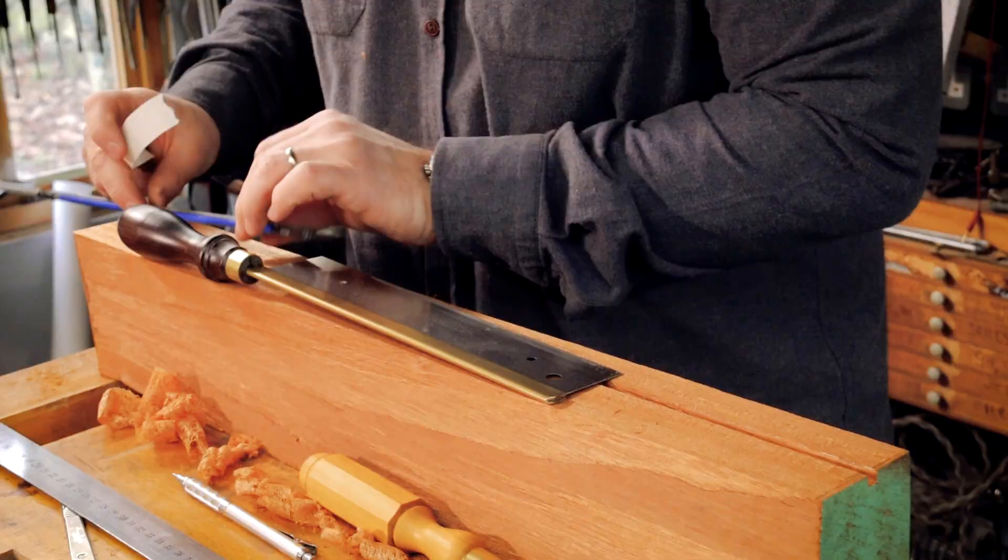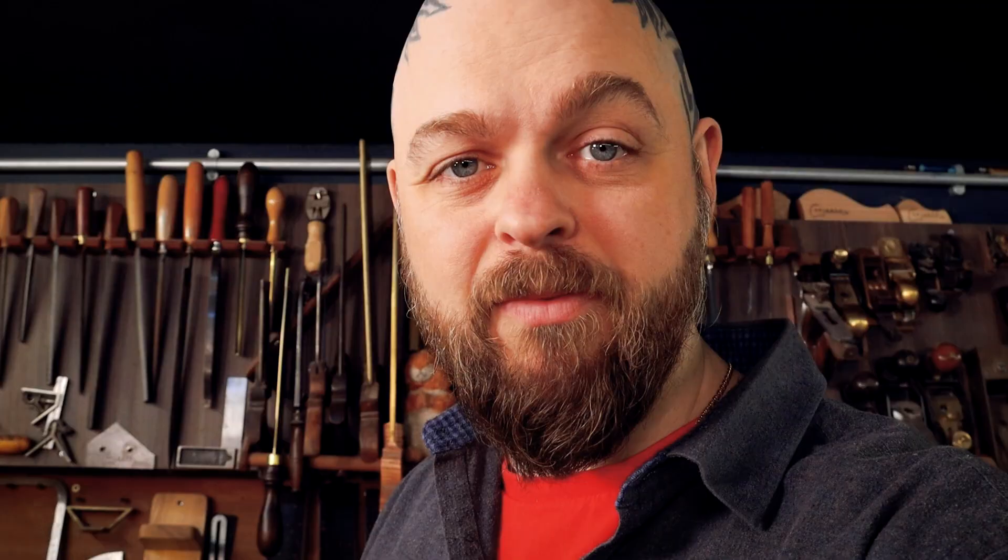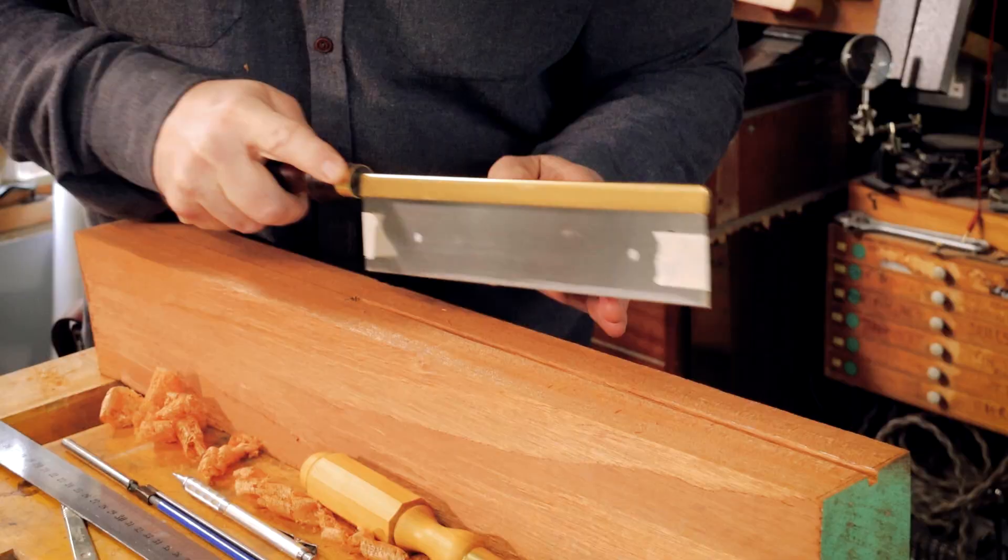This is working very well. I've had another thought — I don't necessarily need to use a router plane at all to guarantee that the depth is correct. You could just use a fret-slotting saw and a depth stop, or in fact any sort of saw and a depth stop, as opposed to cutting with the razor blade or scalpel down the edge — cut with a saw. Especially in this channel where it goes off the edge.